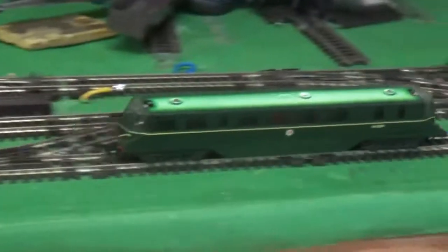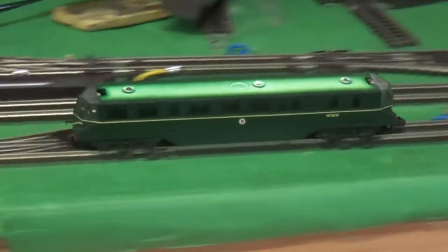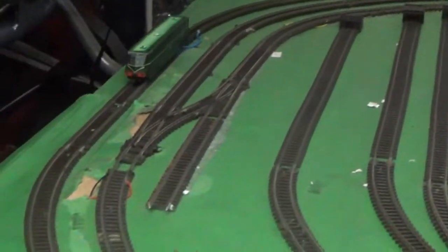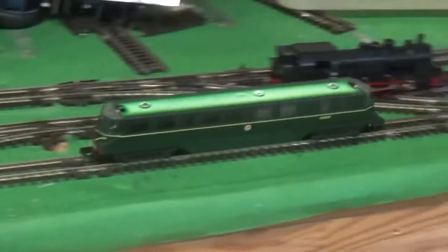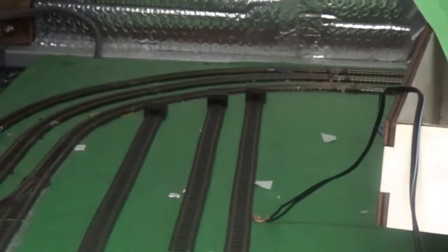Turned out a wee bit easier than I feared when I first saw that the case top had been prised off. Then I found the motor poles are missing, and one starts to think all sorts of things. Still don't understand why you would just remove those bits and put it all together again. Never mind, one of life's mysteries. Well folks, I hope you liked that. I didn't show you too much repairs going on there, because there wasn't really much to repair. Just replacing the poles, stripping it down, lubricating, putting it all together again. I'll fit the roof in a day or two when I've left it with time for those pins to set.